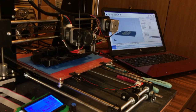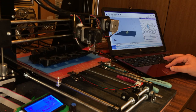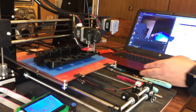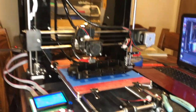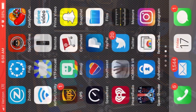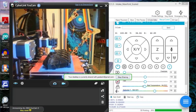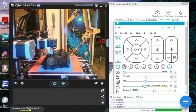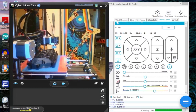A lot of the longer prints I actually printed while I was at work, and I'll show you how I set up the remote viewing. I'm printing off the SD card but I'm using Repetier Host connected so I can override any of the settings with the laptop. I opened up the camera and pointed it at the printer, left Repetier Host open, and brought up Google Chrome Remote Desktop. Later when I was at work I could bring up Chrome Remote Desktop, log into my laptop, and see if it was still printing. If it wasn't, I could stop the print, turn off the heaters, and then come home and retry. I was pretty lucky — I didn't have anything fail so I didn't have to override this at all.